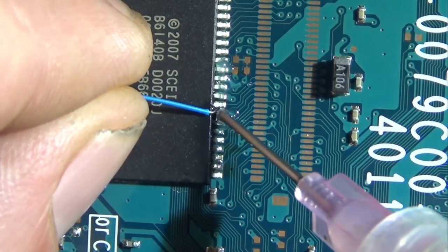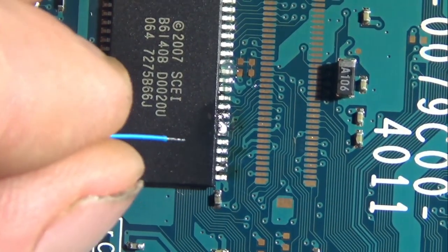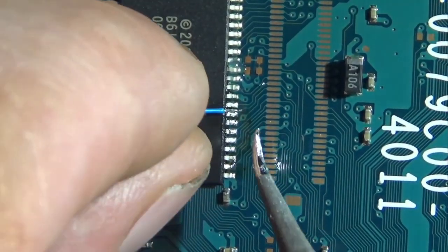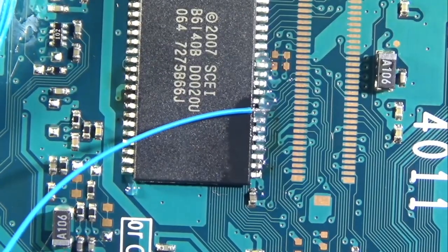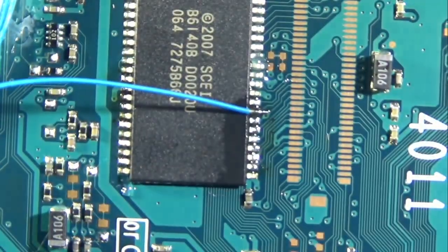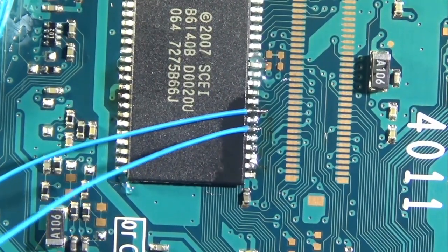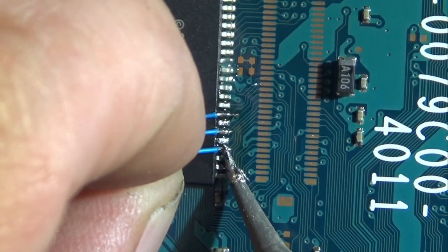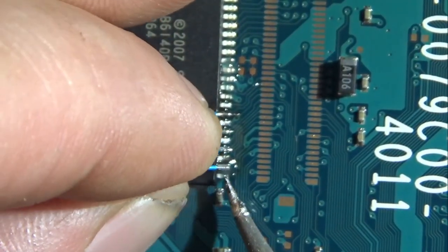As you can see, we already got a bridge there. I try to flow it out and do my best. The strat there is: clean off the tip, add flux, just give it a swipe, clean the tip, swipe, clean the tip, swipe. The iron is absorbing the solder and you're cleaning that solder off. Rinse and repeat until you clear the bridge. That is a pretty good strat to keep in mind. Sometimes it's just taking too long — just use your braid, use some goot wick, and be done with it.